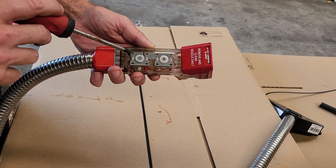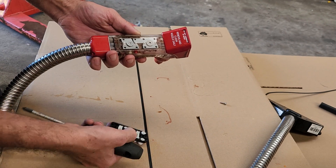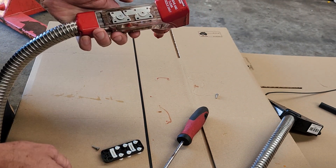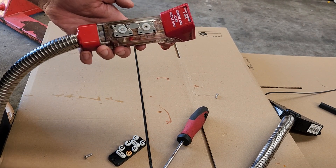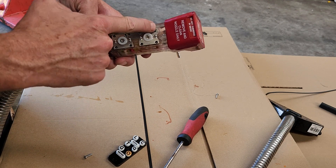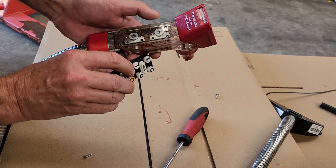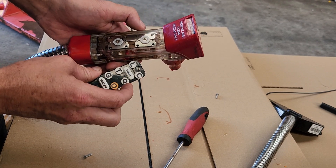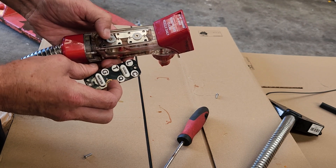The top two metal plates do soda water and the bottom two do plain water. When you press the soda water button, it pushes down those two plates and you get soda water. When you press the plain water button, it pushes them both down and you get plain cold water. This plate and hole here does orange juice. The longer plate with three holes controls soda water for lemonade, tonic, and ginger ale. On the other side, cola and squash get mixed with soda water, and orange juice at the bottom gets mixed with plain water.